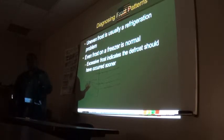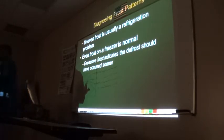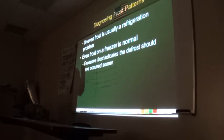And the copper actually rotted from them using, I guess, cleaners for 20-something years and spilling salads, vinegars and salad dressing. Salad dressing has a way of eating up the aluminum, eating up the copper, because I changed a lot of little blower units for these delis that have that sort of stuff with salad dressing.